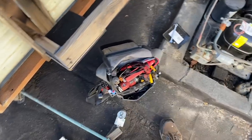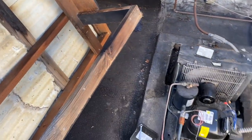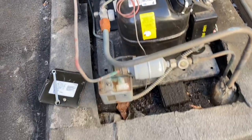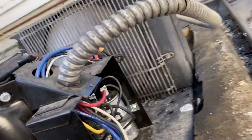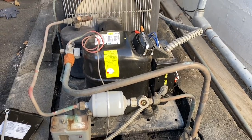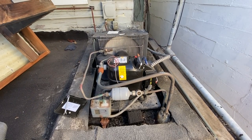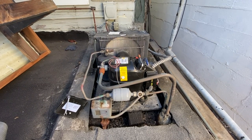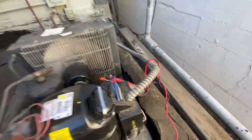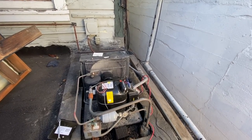Those two are basura — they're going in the trash. And that's my stash; even though I have a stash, I still don't have the right one. I ended up using the ICM Universal Potential Relay — it's a great product. I picked those up at RSD; they're hanging on the shelf where all the ICM stuff is. I'm going to let it run for a bit and we'll keep an eye on the amps off the motor. We'll see how it does as it runs here and see if that condenser fan motor is puking out.